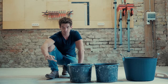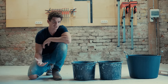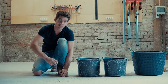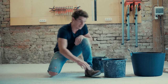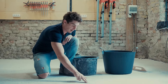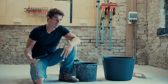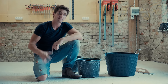This floor has a couple of problems. One is it's very dusty. When concrete is laid with a little too much water, the water rises to the surface bringing cement with it, then evaporates leaving a powdery substance — that's called laitance. It's a powder that nothing adheres to. You want to sweep it up, because with bare unsealed concrete you'll always have dust rising off the floor no matter how much you sweep.